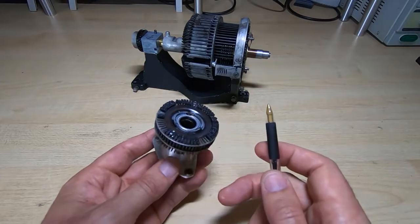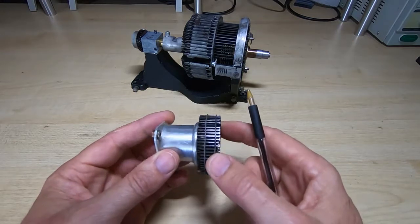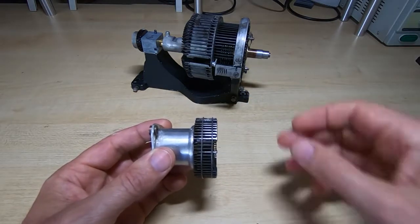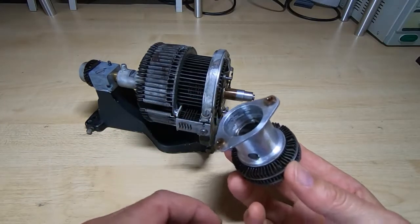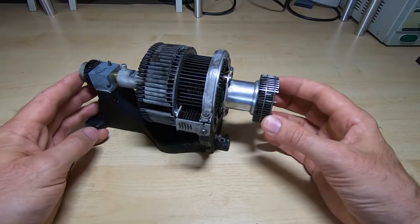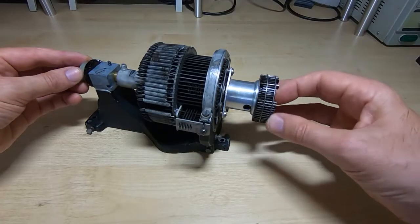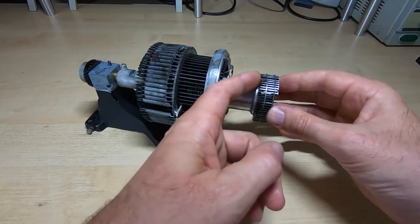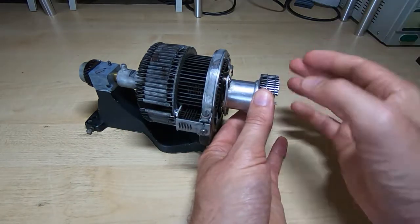So really the entire purpose of the machine is to select one of these pins for impacting onto the paper, and as we looked at in the previous video, that is done using the selector drum, which is this, and the print head itself sits on the pins on the end of the selector drum. So the entire purpose of this part of the machine is to select the correct pin, align it in the right position, and then there is a hammer that pushes the pin from the rear and onto the paper, and the paper is fed through the rollers on this side.